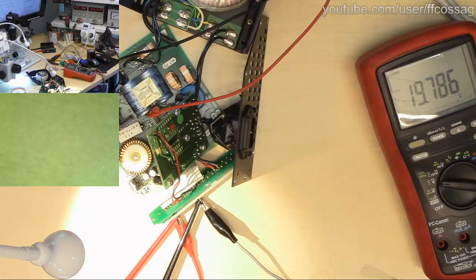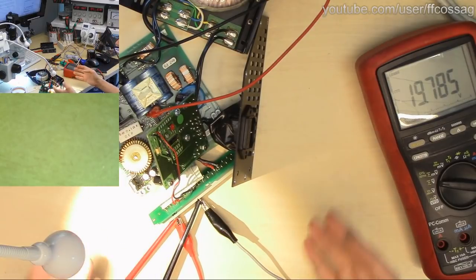And it's still fine. Let's just keep going a bit more. It's just an LM2941, so it's not going to be super sensitive as part of it. So 400 milliamps go, and it's working just fine. Hmm. 500 milliamps maybe? That's a lot of current. I really don't think this regulator is a problem. So 500 milliamps go. Yeah. The 19 volt is not our problem. That's going to be fine.